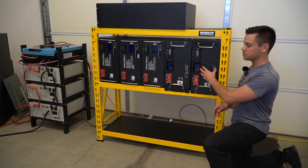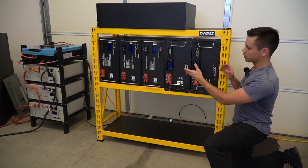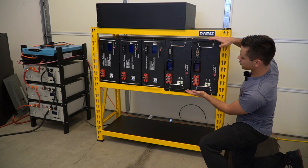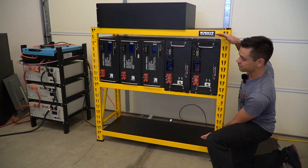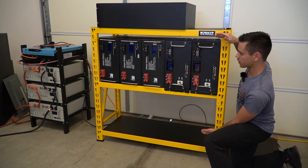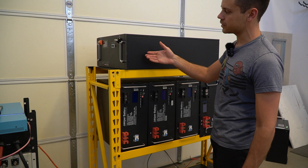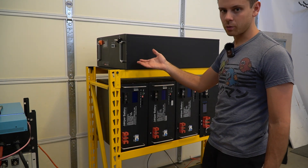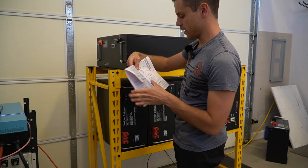The hardest part is actually putting these batteries on the shelf. Right here we have five 5-kilowatt-hour server rack batteries, so that means you can put 25 kilowatt hours in each shelf. If we loaded up the bottom shelf we would have 50 kilowatt hours right here — but wait, there's more, and you can stack them on top. This is a Trophy server rack battery, 220 amp hour, 48 volt, and this thing can hold a ridiculous amount of weight.